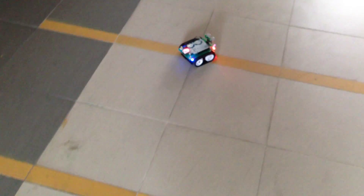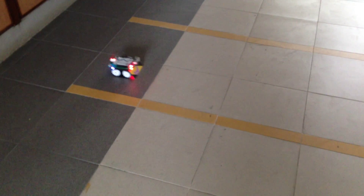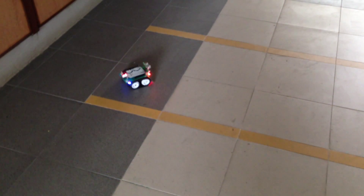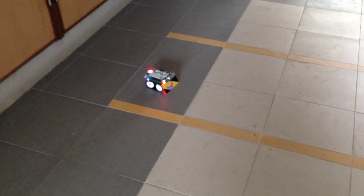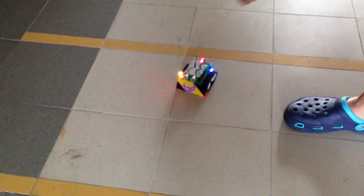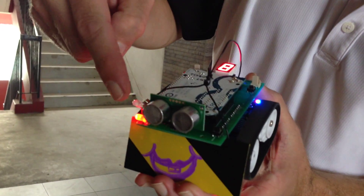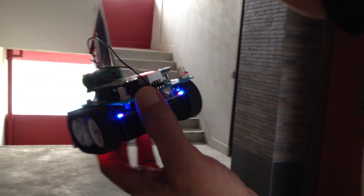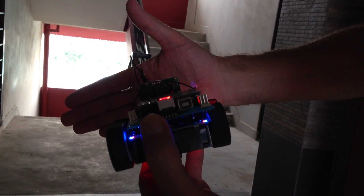And now it's going to play the tune again. So if I go a bit too close to it, it will just suddenly avoid me and go in a different direction. So the notes are shown by the number, and we've got colour coming up here also to show which notes are which. And what's happening is that every time we're processing a note, we're also just checking the distance. So it suddenly interrupts there when my hand gets close, but then it just carries on afterwards.